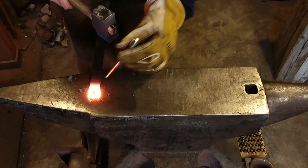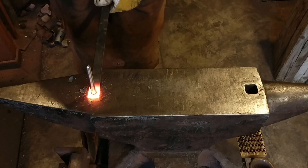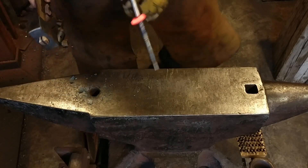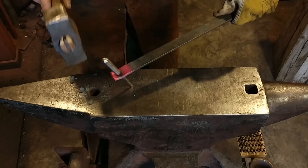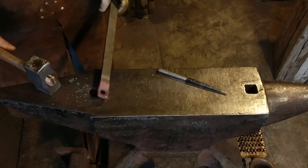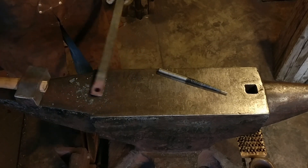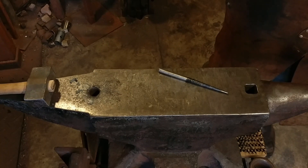Some of you may be asking: why did you choose to use stainless steel as a drift? Well, frankly I just wanted to try making a stainless steel drift and see how it holds up. Stainless steel is quite a tough material — even 304 stainless is fairly tough in thicker cross sections to forge; it's a lot tougher to forge than mild steel. I just wanted to see how well it would hold up, and so far it's doing pretty good.